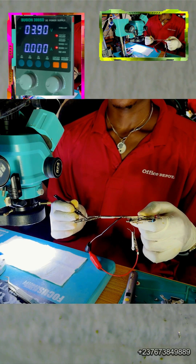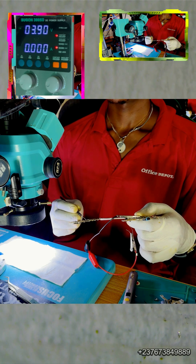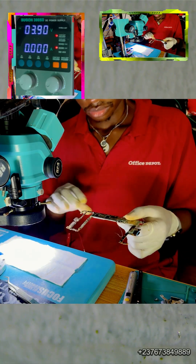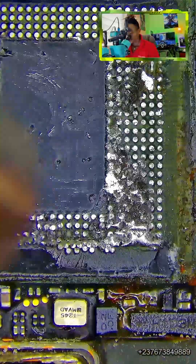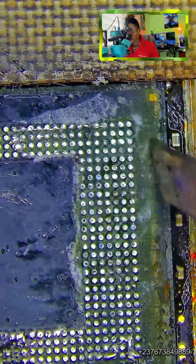From my knowledge, that's a problem with the RAM. We have a double-mount CPU — the CPU and the RAM mounted on top of the CPU. That particular reading has something to do with the RAM of this mobile PCB. So all I had to do was remove the RAM. I removed the RAM, cleaned everything. It had a lot of glue, so I had to clean the glue.